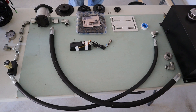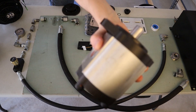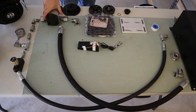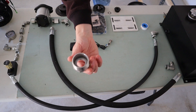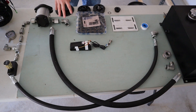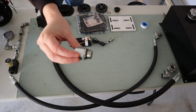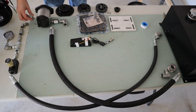Starting at the pump — the pump here is a Dynamic Fluid Components 3/4-inch shaft pump. I picked that off of Amazon, but you can get it from places such as Northern Tool. It's one of those tried and true tested pumps. All of the adapters came from the same location with the exception of one — my 1/2-inch to 3/4-inch adapter, which cost $30 at the same place but only $10 on Amazon. Coming off of the pump is a 5/8-inch ORB or SAE-10 male to a 1/2-inch NPTF female adapter.